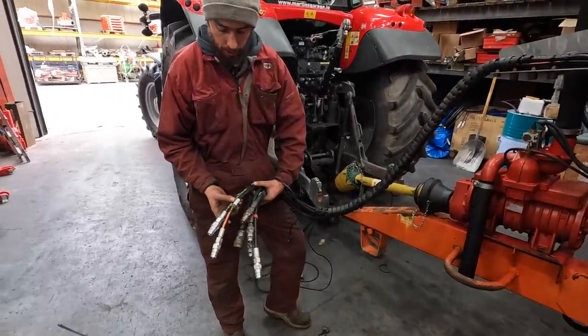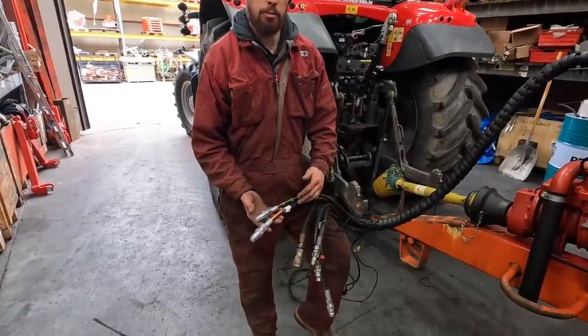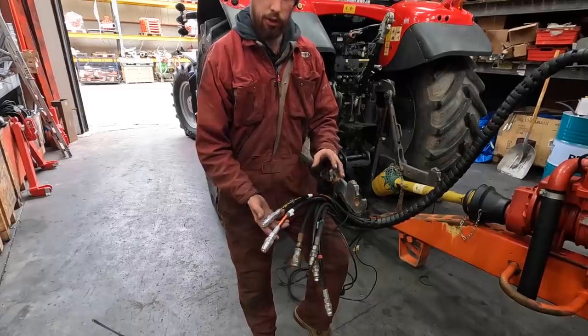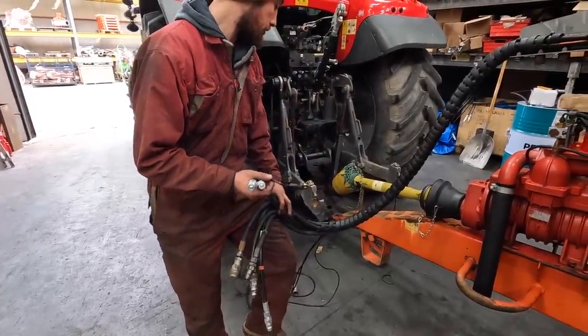So we have two pipes here with green tags on them. They're going to the solenoid, so they will work your arms and mast rail. So the first function is your arms will go down, and then our switch, which is connected up here, that I've put over here.